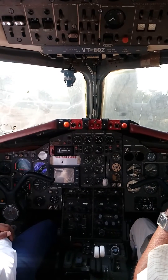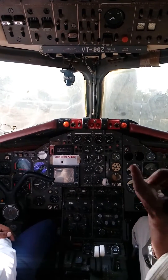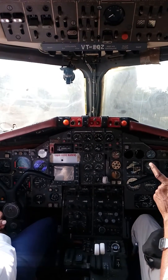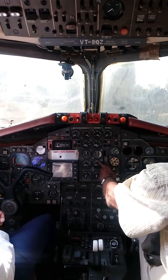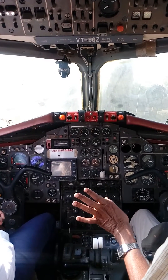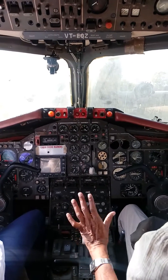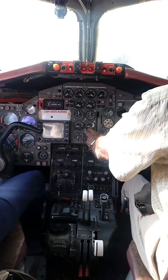It will make a smooth start. It will start moving slowly, then faster, because there is no accumulation of fuel — the fuel running is getting burned, so no accumulation takes place. Within the time it has taken light-up, this will go very smoothly and may touch 600 or settle around there. It is a very smooth, comfortable start of the jet engine. We think it has made an in-time start.